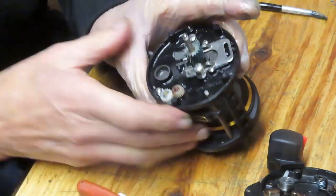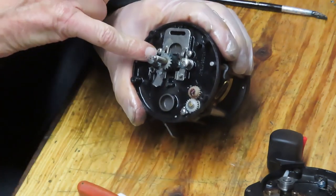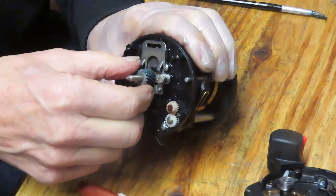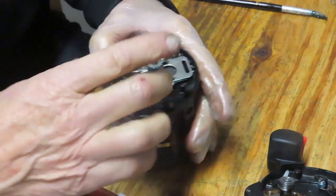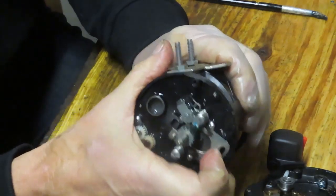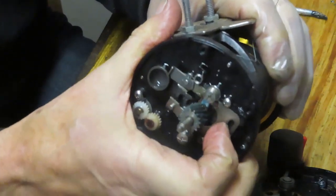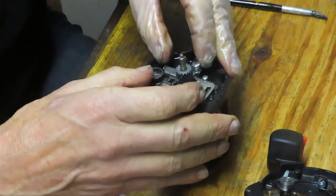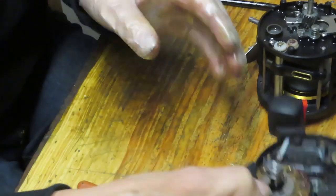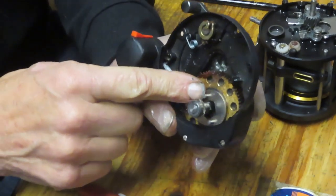That's that. Alright, so this is the way we found it. Remember what we did? We added the two screws there, the spring washer behind it. And now this should pull in and out pretty easily. You'll see how that operates when you're going to use a lever, how it's pulling it in and out to do that. And then you've got your trip lever below here, which will be driven off this back click here. That's what this is about.